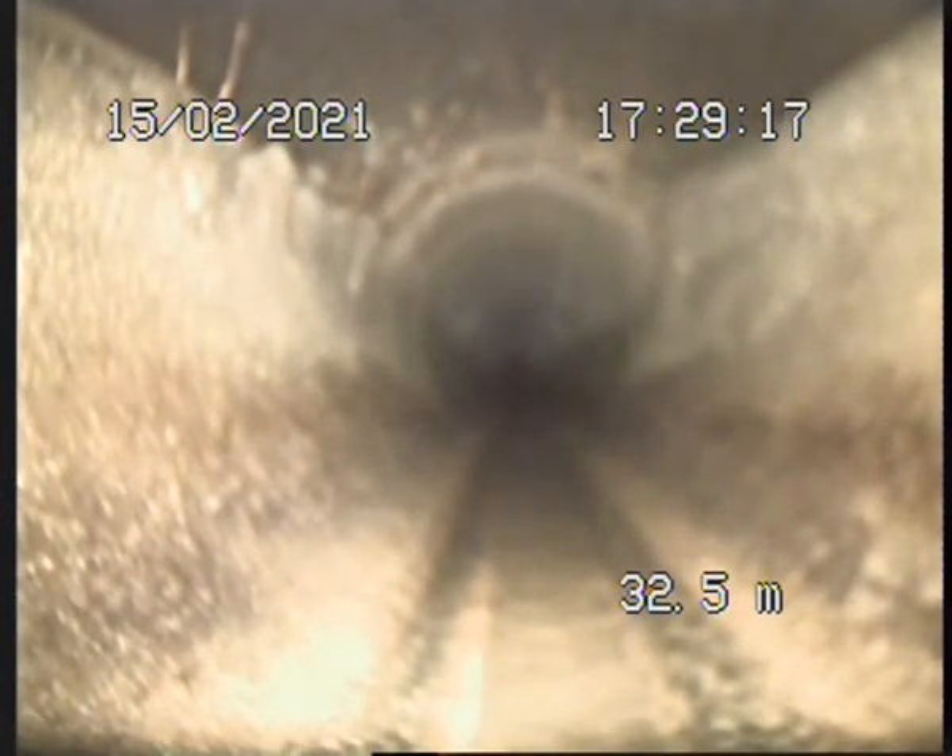So literally, the issue is pretty much the problem from this manhole. When we started, all the way about 17 metres, the pipe has been repaired multi-point. And unfortunately they're not the best — they've got a gap, a bit of displacement. And you've got some sand, or should I say some drainage metal, sitting inside your drain as well.